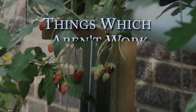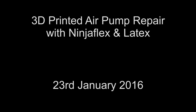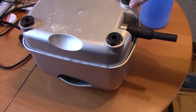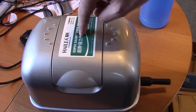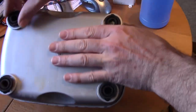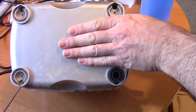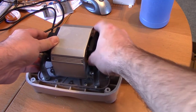I'm going to give you a quick look inside this air pump and show you what I've done. Getting into this thing actually took me a while to work out. There are four feet on the bottom held in by four fairly short screws, but if you take those screws out nothing happens. The secret is: if you take the rubber feet out there's another set of screws buried underneath in the four corners — take those four screws out and then the lid comes off.